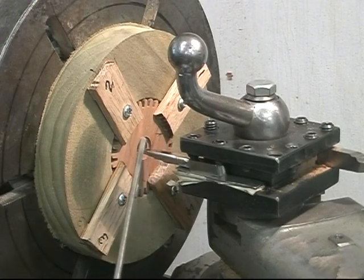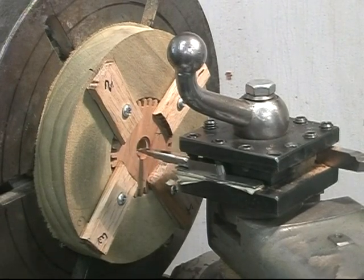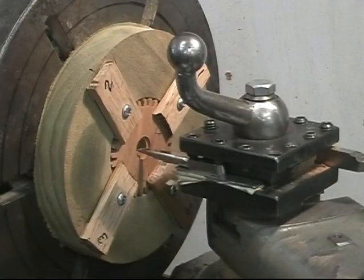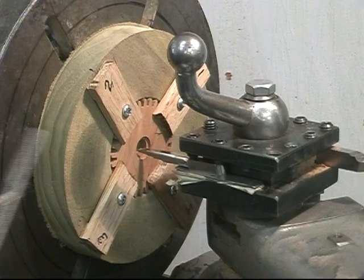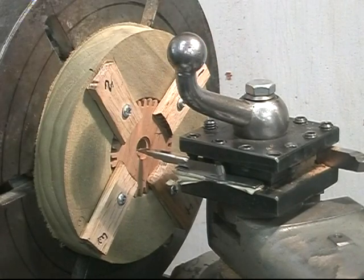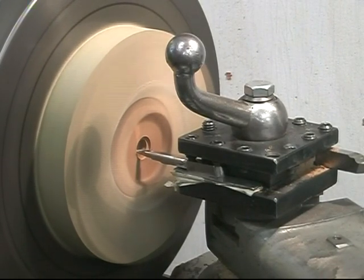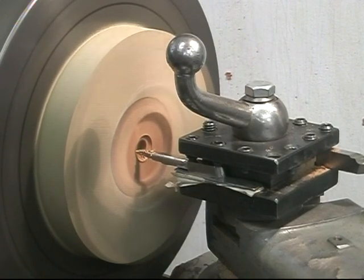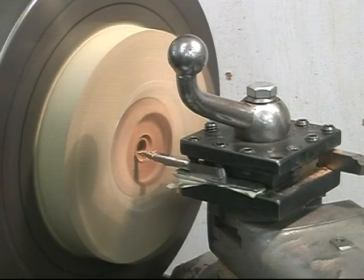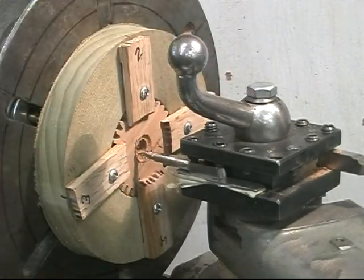On this gear, it requires a counter bore and a tapered clearance for a washer that gets nailed to the hub of the gear. Well, I use the same tool to do the facing and generate the angle. The compound is set at 30 degrees, so what I'll do is face to a given point and then crank the compound out to generate the angle. Now all I have to do is sand the little burr and that will be complete.